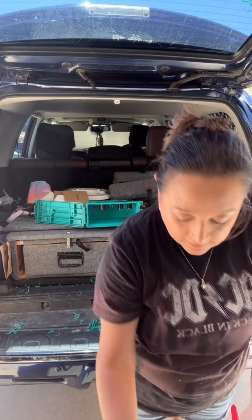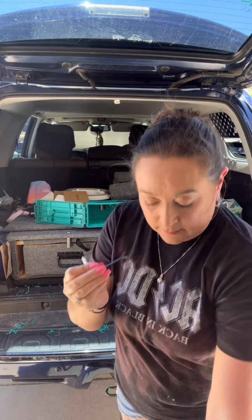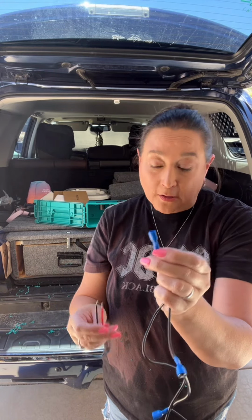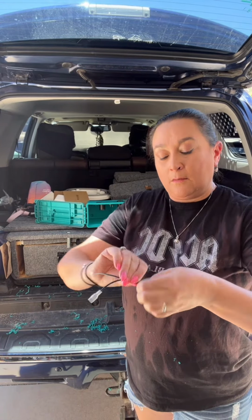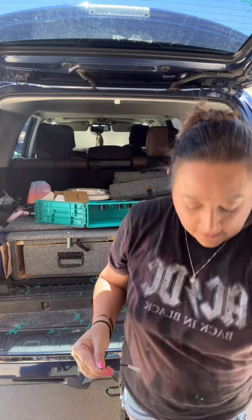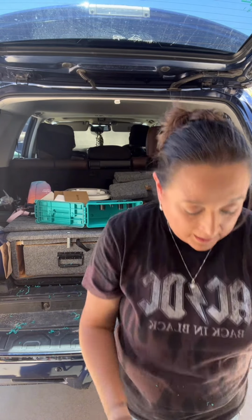So then you're gonna strip your wire on both. And we've now learned that this is 14 gauge wire. Okay, so you have two ends that are stripped like that. And then what you do is you take one of these trash connectors, or a better one, preferably better one, and now I've got the two pieces, the one that's connected. We've got another one that's gonna go to the next thing. We're gonna put them together, and then you put one of these little connectors on, clamp it down.